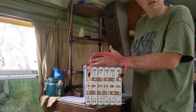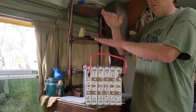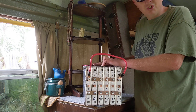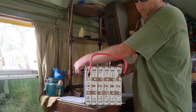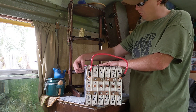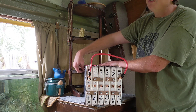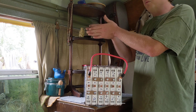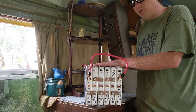AGM is supposed to be the second-best thing to lithium right now, but you can only discharge it 50 to 60% at max — and they don't even recommend you do that all the time. These lithium modules you could theoretically bring down to 10% every day. And when that comes down to these guys, that just means another $240 for another 1.2 kilowatts — another 1,200 watt-hours of usable lithium. The Ford Focus batteries come in a weird 7 to 7.75 volts, two modules combined — then those two packs are put together in larger packs. Nobody was thinking about long-term use of these used batteries like Nissan was.